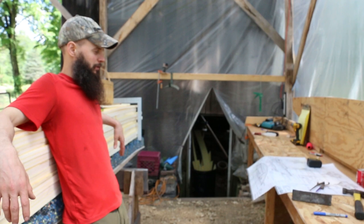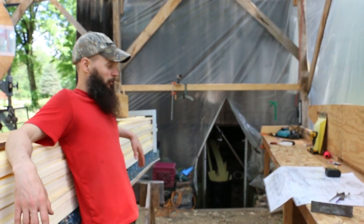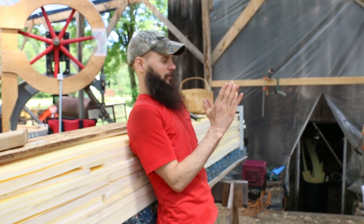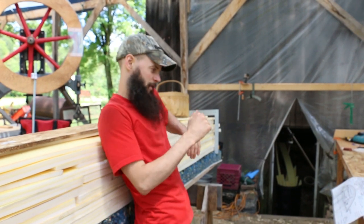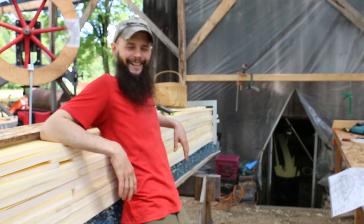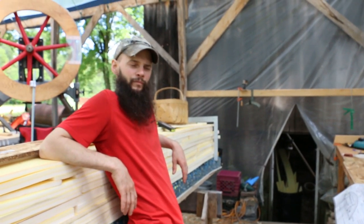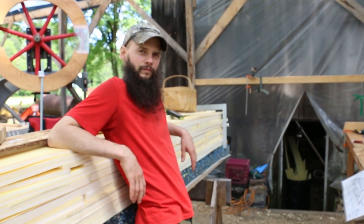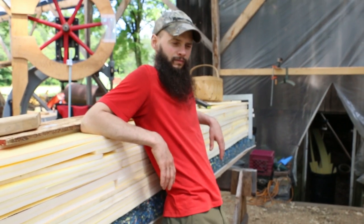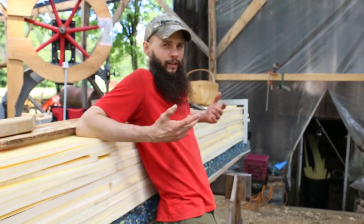But then why not just keep the shape of the iron and make it a little bit longer for the lead? It's a very excellent question. And if you're worried about the strength of the lead, maybe a narrower, taller piece of lead is going to be more rigid than a shallower, flatter piece of lead. Yeah. So, I mean, we can go logic all day. The only thing I can think of is that it would be easier for him to figure out the weight of the iron keel for a squarer piece than it would be for something with lots of rounded edges. And so, as an addendum, it would have probably been easier for him to have just a square chunk of lead.